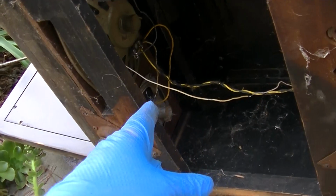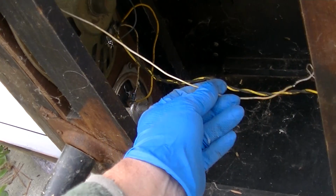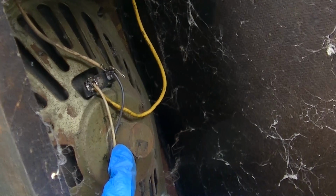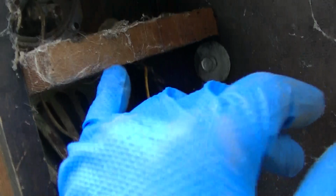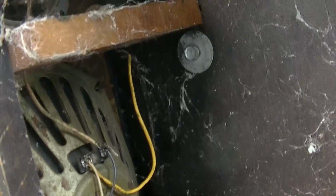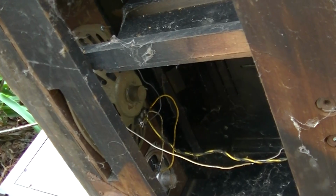Okay, I got the speakers fixed here. I replaced the missing nuts, so they're held down. I just put a 2.2 microfarad electrolytic there. Don't really care about this. I have a theory with this disc capacitor. Once I get this speaker connected, it's going to pull the peak voltage down below the 3 volts that disc capacitor starts screwing up at, and it's going to sound okay. So I think I got this half-ass fixed. Let's see how it works.